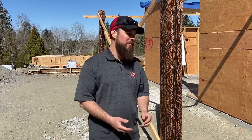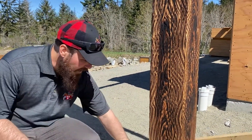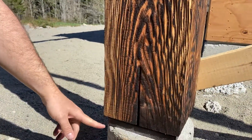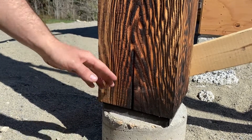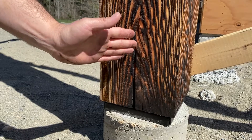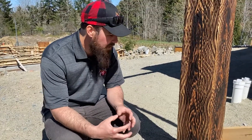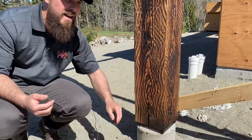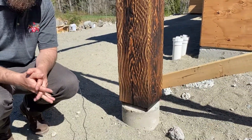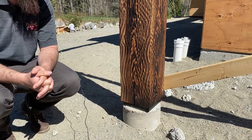On this house we ended up doing the Shou Sugi Ban textured posts again. We used a metal bracket on the bottom — one inch so it sits up off the ground, with little cuts in the corners so that water can seep out. Then there's a piece of metal that goes up called a knife plate, which anchors it to the ground without being bulky with hardware. We drilled some holes into the side and pins are pushed through there. It's a great Simpson product and this is our second time using it and we're really happy with it.